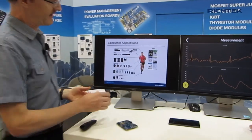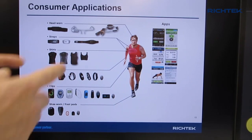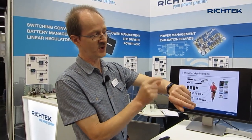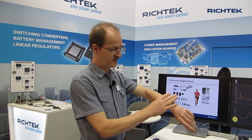Another application could be a sport watch, or a sport watch including a belt. When you are exercising and after your exercising you would like to measure your heart rate but also your blood pressure — it can be implemented in just a single watch. The LED sensor and the bottom electrode will be connected to your wrist, and you can add two sensors on top of your watch to measure the ECG pulse. By combining these two signals you can get a measurement of your blood pressure even in a sport watch.